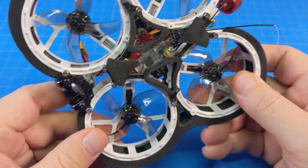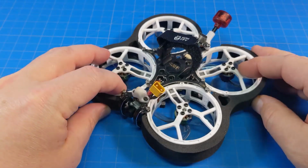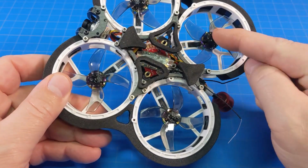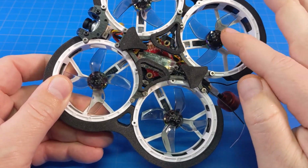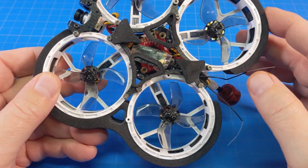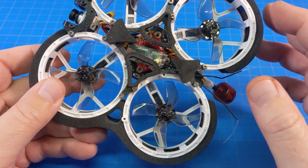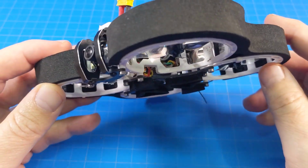I did mention the camera, the foam here. Sorry, this is the foam. I like the fact that you have a landing pad. That's kind of nice. So you've got a little bit of extension off this location of the prop. I'm always concerned about the props being obstructed when we're turning them. That can cause big problems. Of course, we have a big amp rating, which should be fine. You should notice that if your prop is stuck, you wouldn't burn the ESC, you would have some other sort of alert, like maybe a runaway alert.